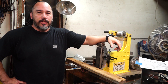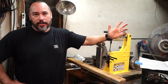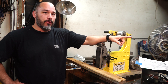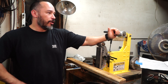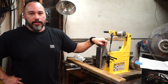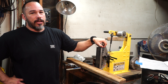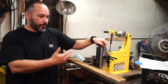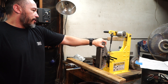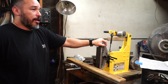The motor I got to go with it was just an eBay motor — about $220. I'm not sure if I chose the right one; I chose what everyone on Blade Forums told me to get. I got the 1800 RPM motor at 2 horsepower. They were saying you can use the doubler in your variable speed drive — the VFD — to get that same 3600-3700 RPM. To me, the more important horsepower is on the top end when you're hogging with a 36-grit belt trying to knock off the most metal. But that's what everyone said to use, so that's what I got. I think if I'd gotten the higher-speed one I would be able to grind blades a lot faster in the hogging stage.